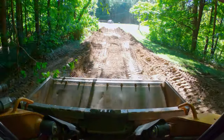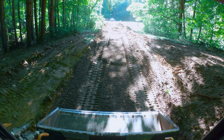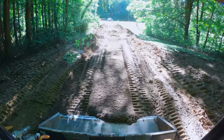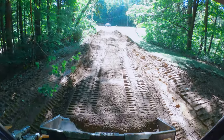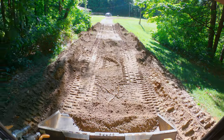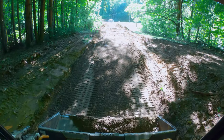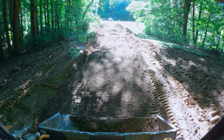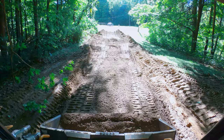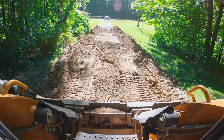Now we're looking at it from the other direction. We've got a lip there from where our grade is — that's okay. We're going to put our bucket down nice and flat, and because this is relatively loose material, I don't need a ton of down pressure. We're just going to shave that extra off, then back drag it. I'm going to get a little more aggressive on my bucket angle, shave an inch or so off, then level back out. Any extra material gets dumped right here at the beginning.